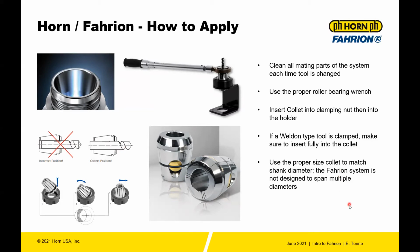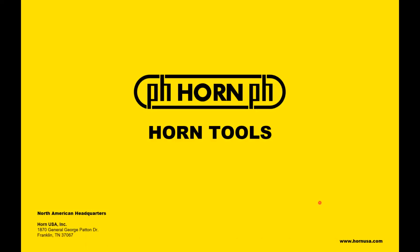Use the proper size collet to match the shank diameter. And most importantly, the Fahrion is not designed to span multiple diameters. So don't use these collets for letter drills or number drills or fractional sizes. Use them for the exact size and pay attention to your tolerance on your shank. Of course, they fit standard tolerance shanks that you'll find on solid carbide tools or drills, but just make sure, don't expect the tool to collapse.